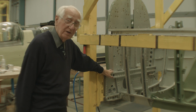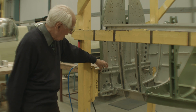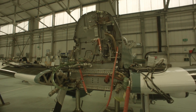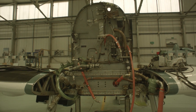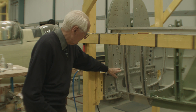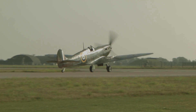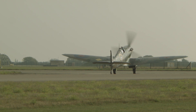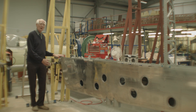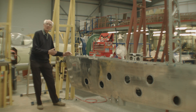This unit here is known as the bridging spar and it's the nerve centre of the Spitfire, because both wings are bolted on either side of that and it carries the wing loading through the fuselage to the wing on the other side, so the whole thing becomes one integral unit — which is why it's called a monocoque construction. The secret of the Spitfire wing is this section here, which is the D-section